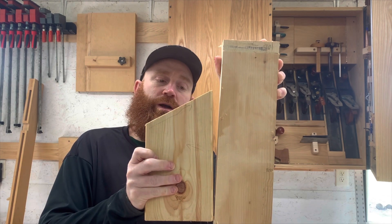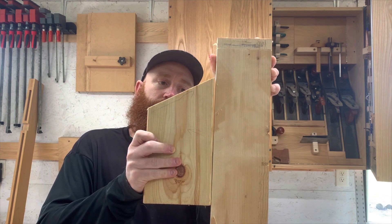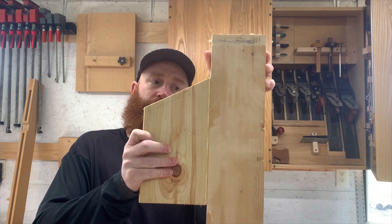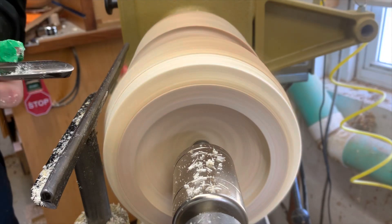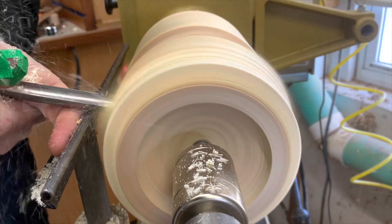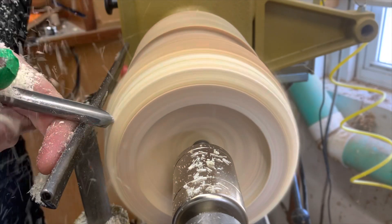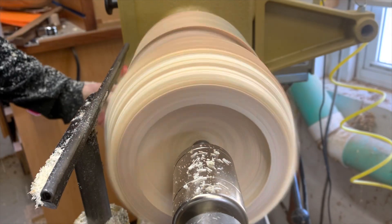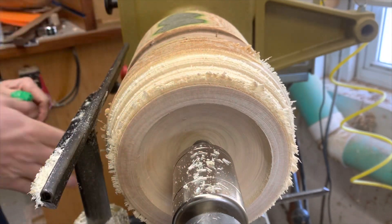You could also turn this tool around. Instead of rubbing the bevel this way, we go this way — rubbing the heel of the bevel down here, no cut. Now I'm flat, probably still not cutting. If I pick this up slightly, I start cutting. If I just jam this in, it does remove material — that's an aggressive cut that removes material. You can see if you just jam it in, that's a scraping cut with the bevel not rubbing.